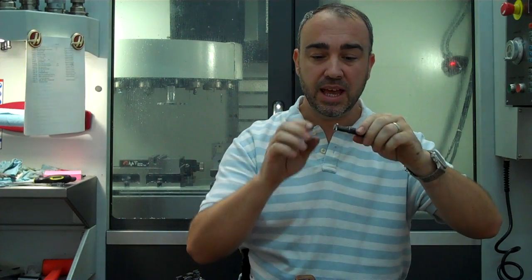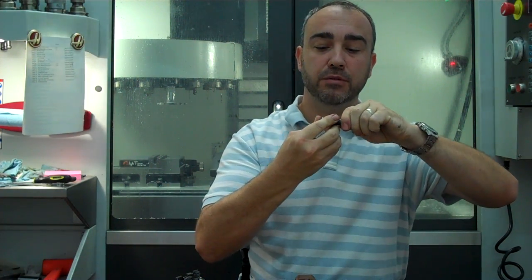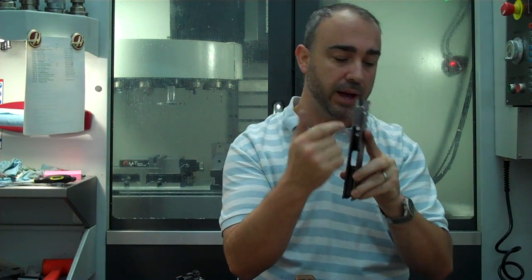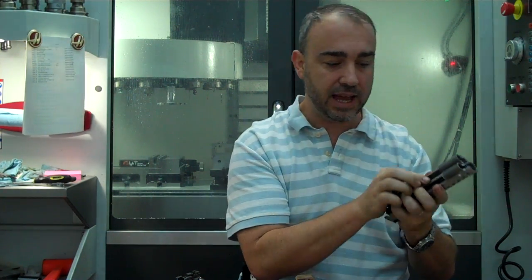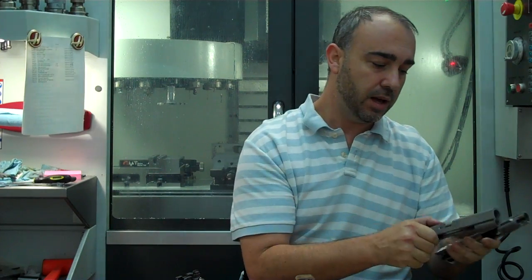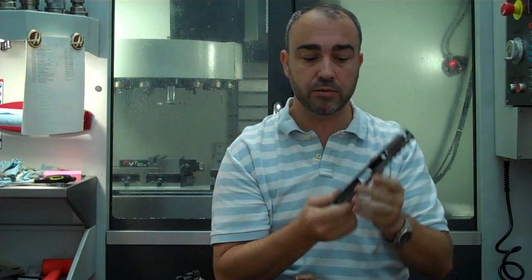What actually happens is the reverse plug bottoms out on the recoil system. That happens before the slide and frame rails impact each other, and that's what stops the rearward travel of the slide. So one of the ways of stroking a gun includes removing material off the back of the reverse plug tunnel. Now, this is a 5.5-inch gun, but you can see we've cut 200 thousandths off the back of the reverse plug. It lets the slide travel 200 thousandths further to the rear.